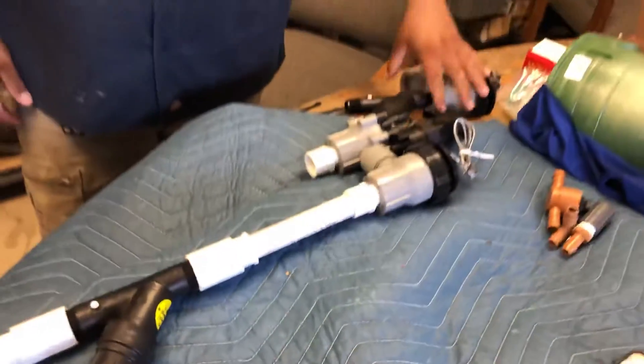So these are just two of the main valves that we use, and you just have to know the right valve for the right application. If you mix things up, the drip zone will fail and will lead to problems. Another important component is installing an ARV air relief valve as well as a clean out — it could be a figure eight or a TLSOV in a round valve box. These are a couple of components of drip irrigation: two different valves, two different functions, but each drip system will succeed on its own.